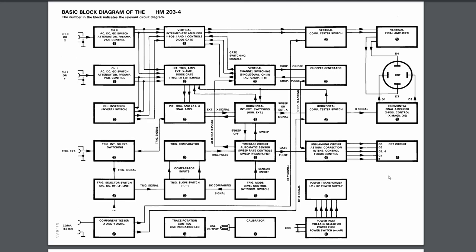To further find where the problem could be, we just trace back the signals which actually have the fault on them. Looking at the signal, it looks like only the Y is affected, however we did see a slight spring figure when we had a very slow time base, so the X might have some small fault as well. But to avoid rabbit holes we'll first only look at the vertical — the Y. That means all we need to look at is the vertical signal, which is fine on any block beyond the vertical intermediate amplifier.